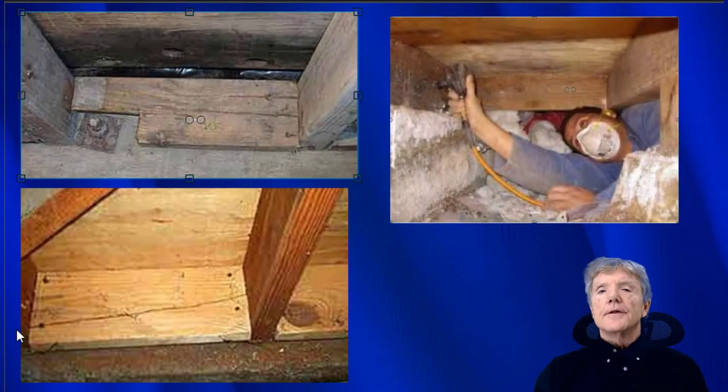I would like to go into the anatomy of installing a block. A lot of times the access to the front of the house is in the back of the house, and most houses are about 50 feet long. So a contractor has to go into the house and measure what the block sizes are. He measures his blocks, takes them, and puts them in a bussing tray, like you see in a restaurant. Then he puts all of his tools in there, nail gun, lights, all sorts of stuff, and he has to drag it 50 feet to the front of the house. A lot of times there are heating ducts he has to go underneath, and it takes a long time to get up there to put your block in.